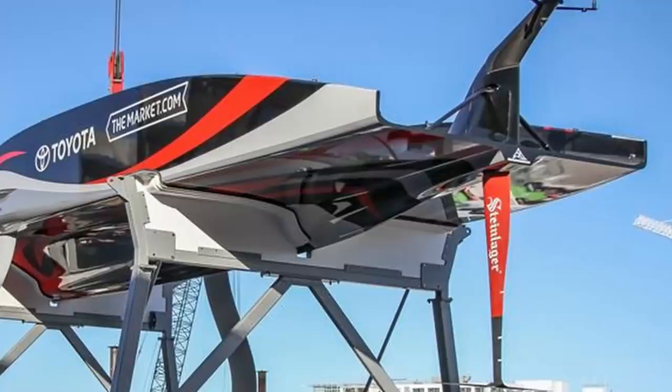You're not going to want to put the boom on the deck either, because how do you rotate it relative to the mast when the deck stays still but the mast is rotating? That whole design philosophy of lowering the rig has led them to the boomless setup, and it's also led them to have their mainsheet within the clew of the sail. If you look at the back of the Emirates Team New Zealand boat, there's no room — it's literally the underside of the hull and traveller, with the rudder in there too. There's no space for a turning block and controls under the deck like Luna Rossa. That's why the mainsheet system has to go in the clew. It might not look great, but remember other boats' sails only really begin where the green camber line is on Emirates' boat — they've got extra sail area down low.